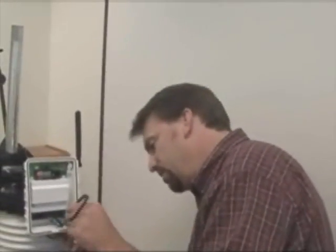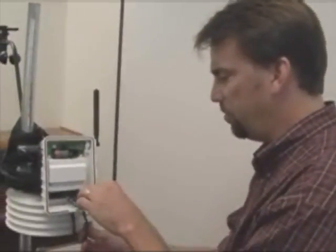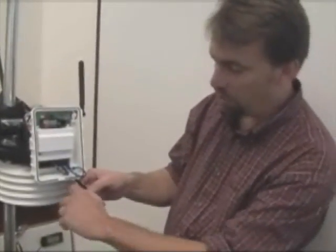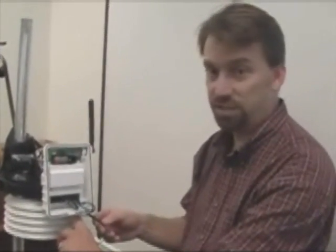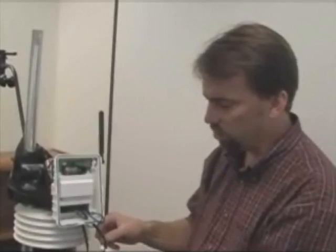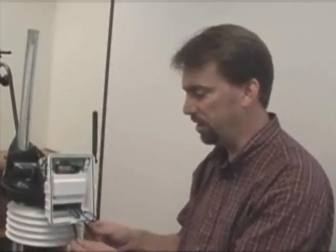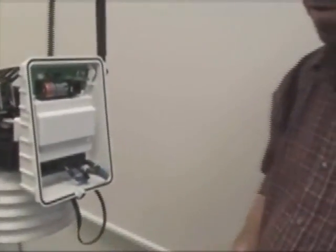There's a lot of play here and some of this cable will be coming out. You want this cable to loop around the bottom in a way so that water will not drip down the cable and into the shelter onto the electronic PC board — the module we just replaced. If this cable has a downward loop before it goes up and through one of the plates, it's more difficult for water to climb up the cable and drip down in. Take a little bit of that slack cable and pull it out so that we get a loop.